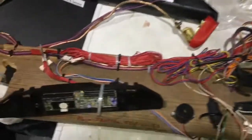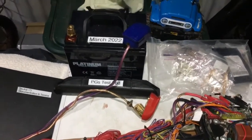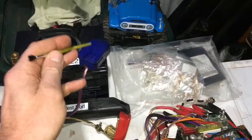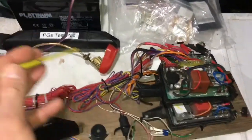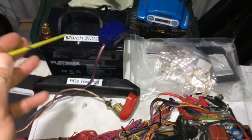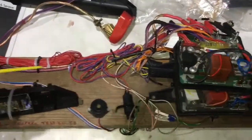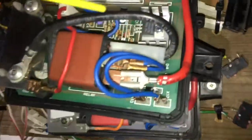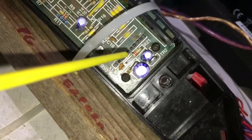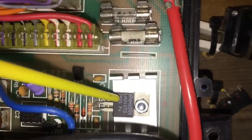My friend connected up the battery the wrong way - a total rookie error. It was a sunny day, he'd hardly ever used the C5, and connected the negative to the positive and vice versa. There was a blatant burning smell from the electronics. He disconnected it when he realized, then proceeded to reconnect it the wrong way again just to double check - double burning, costing him money. R21 was fried on the pod, R1 was also fried.